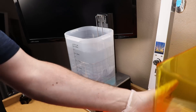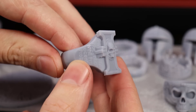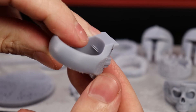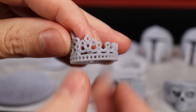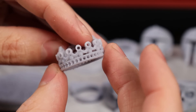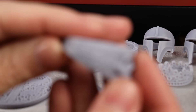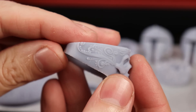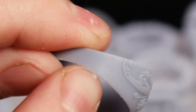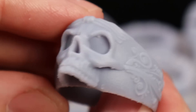I need to take these off the build plate and wash any extra resin off, along with curing them and removing their supports so we can have a better look. This Warhammer 40K ring came out really nice, but there are some weird layer issues on the inside of the band — nothing you couldn't get rid of, but worth noting. On this particular ring, it didn't have supports and was trying to print in midair, so it made these little weird layers. This is all stuff you have to keep in mind when setting up your prints, and it's why it's good to do test prints before using expensive casting resins. Check out the scroll details on this ring and even the small textures on it — you can get amazing details out of this. And even the skull came out really nice with no lines in it whatsoever.